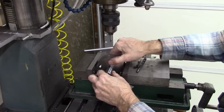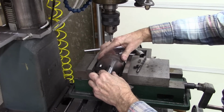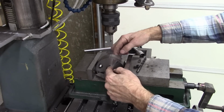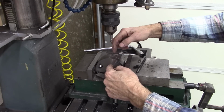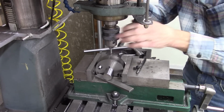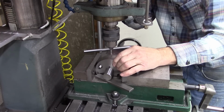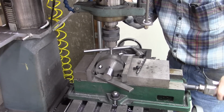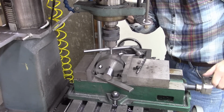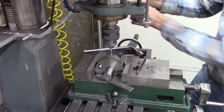Okay. I've got this sitting on a bar, and I got these spacers in here because the bottom of these discs was hitting the lead screw on my vise. But I got the same distances here from the back jaw to where I cut my keyway, so I'm all set up. All I have to do is line that end of that drill up with that little mark I made and tighten the vise. And I should be perfectly lined up. That rod going through there keeps everything square this way.